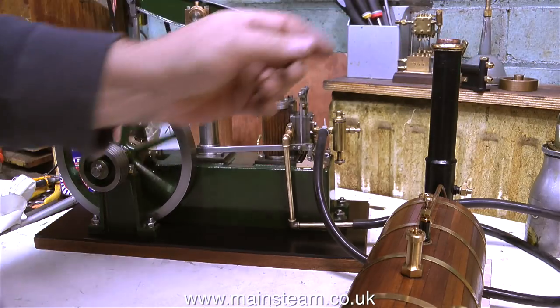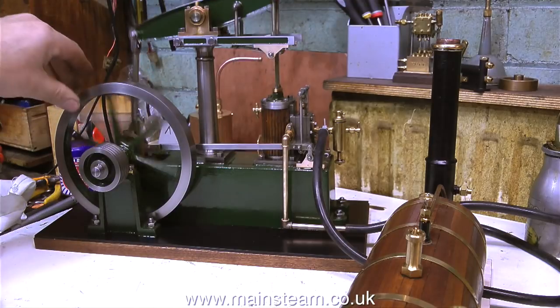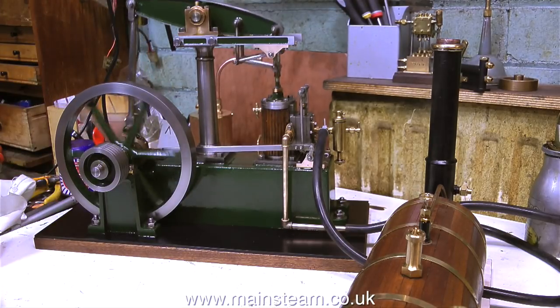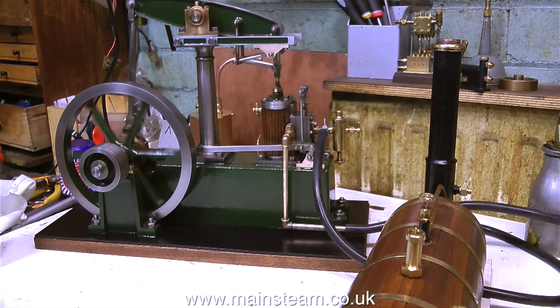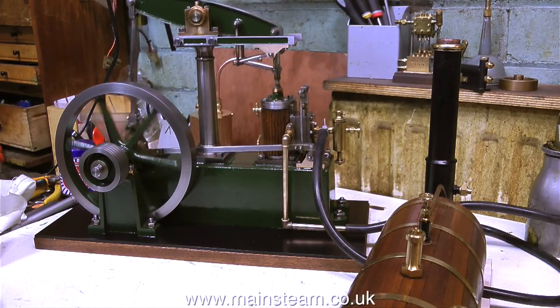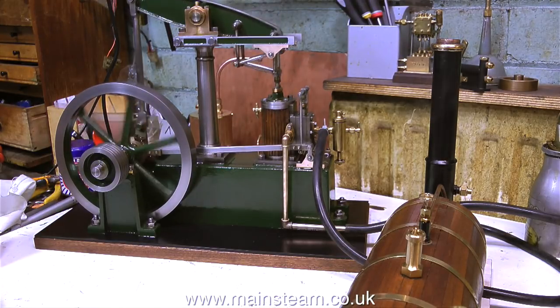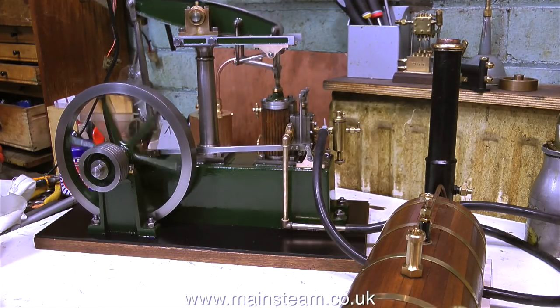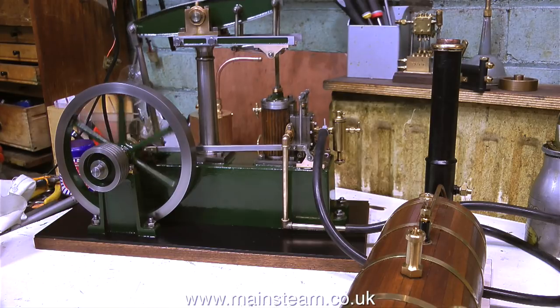In this clip, I'm moving the position of the extension to the exhaust pipe in an attempt to get rid of some of the water that's making the gurgling noise. The engine itself is almost silent, so this is going to be a very successful and pleasant steam plant to run. So what was originally designed to be a two-part series is going to be slightly longer — I need to make the condenser for the steam engine and do something with the boiler mounting base. I have a good idea for this that may look quite good. Thanks for watching, and I hope you found it useful.